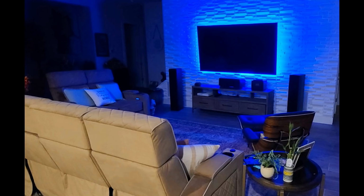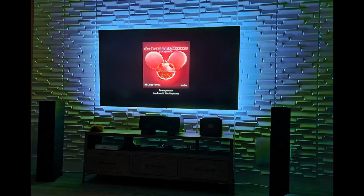And sitting on the couch, whether I sat on any of my 4 seats, I was getting very good vocal intelligibility. And what I was impressed by is that the driver complement in the center channel is smaller. They have 2 5.25s, only a 4-inch mid-range and then the 1-inch tweeter. So I was expecting them not to sound as large as these speakers, but in actuality, they had the high sensitivity these speakers have, and they have plenty of dynamic output to fill this room with satisfying levels.